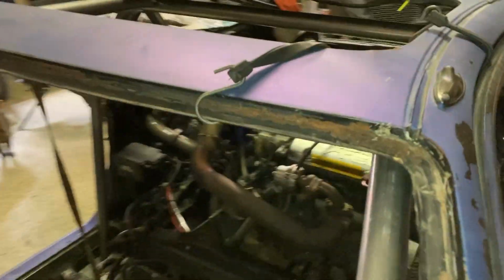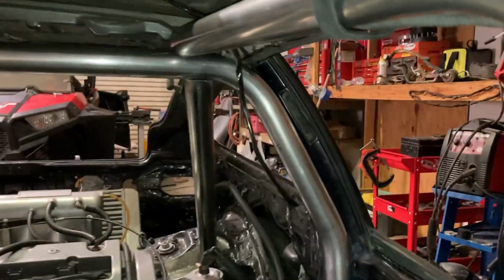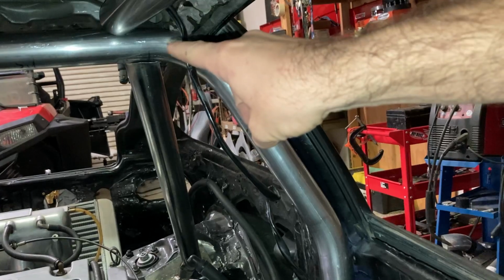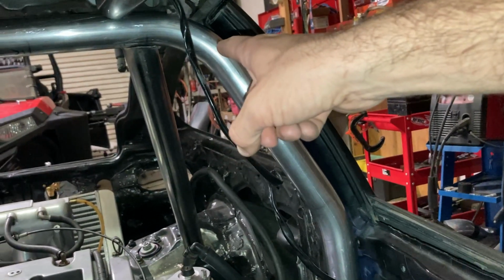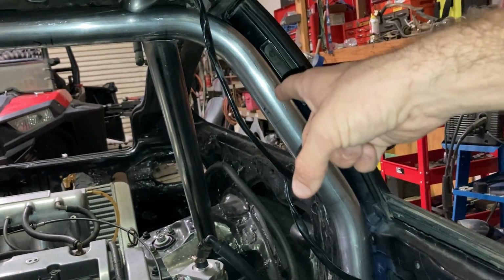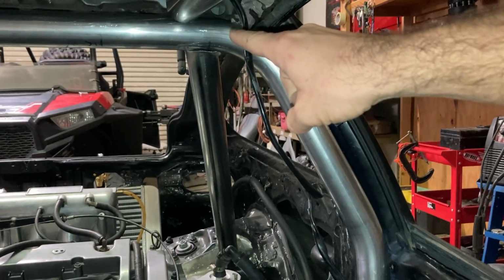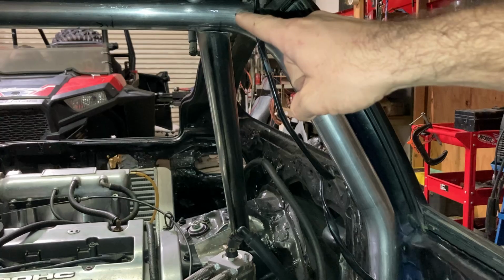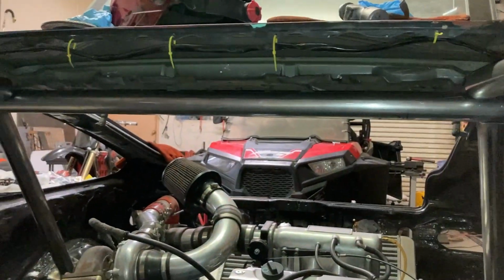And that one was because when I measured the distance between those two bends, I didn't take into account, because I had never bent nothing, that the bend was not just going to instantly start and go down. You know, it takes a little bit of time for the bend to start going down, and then it takes even more time for it to be completed. So really, the bend's not completely done until 3 or 4 inches away from where I actually started. So I basically end up building the distance between the two bends too much.